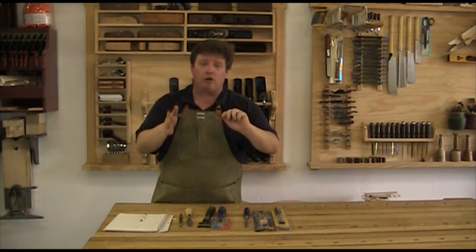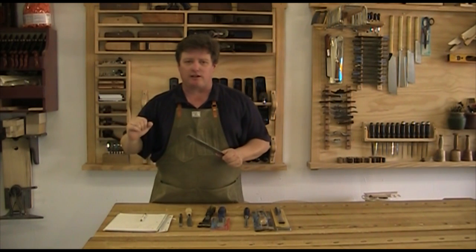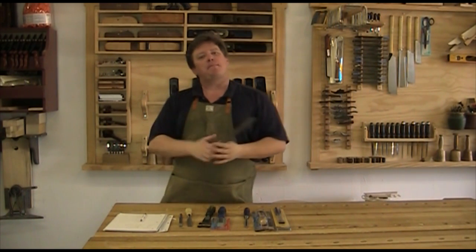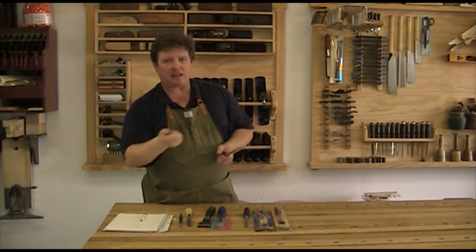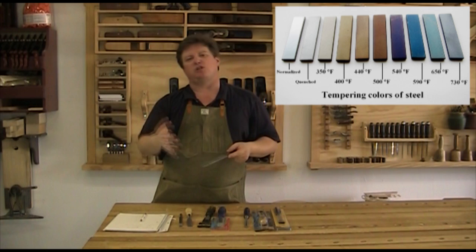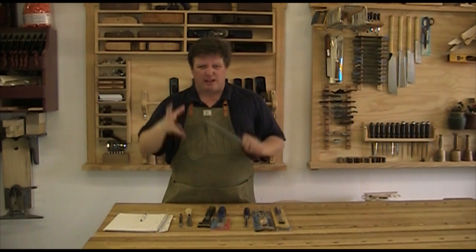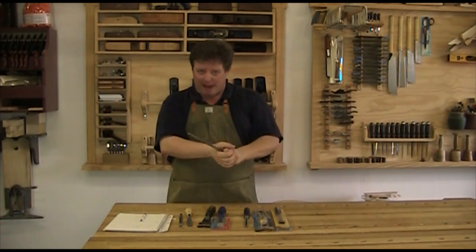Extremely hard. You can use a steel file to cut other steels that have been softened a little bit, because the hardness of this will break the softer steel. How do you make steel softer? Well, that blacksmith will take that sword out of the water and he'll stick it back in the fire and shake it a little bit. Basically what he's doing is heating it back up to just about 350, 375, 400 degrees to soften it just enough so it's not as brittle anymore. It'll take a hit with another sword in battle.